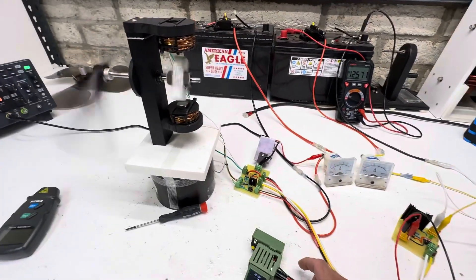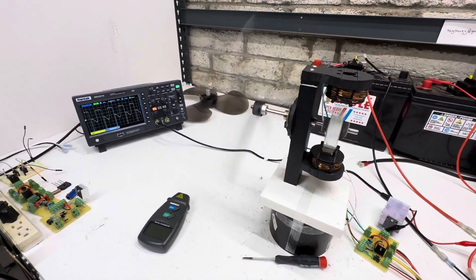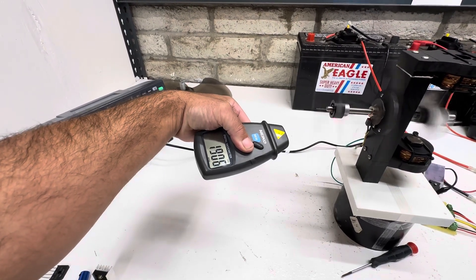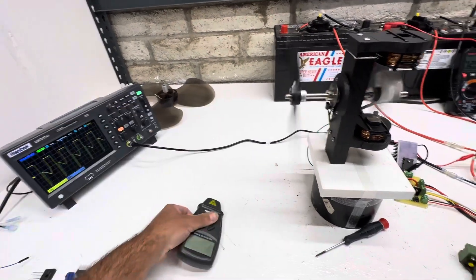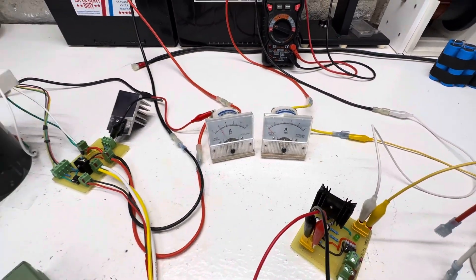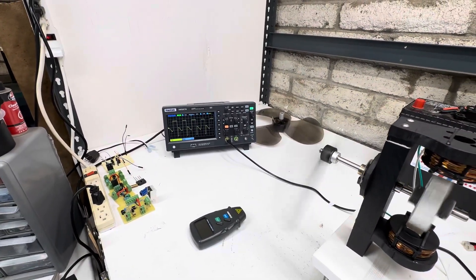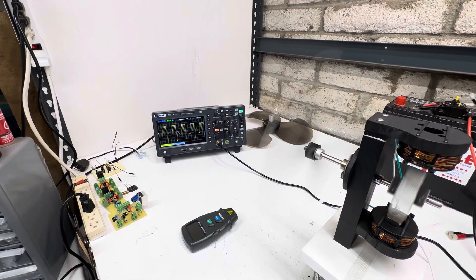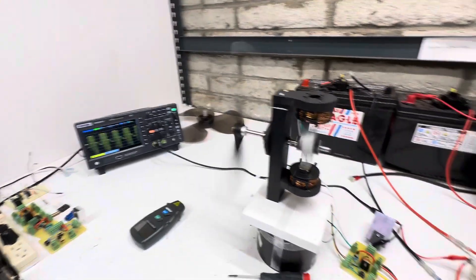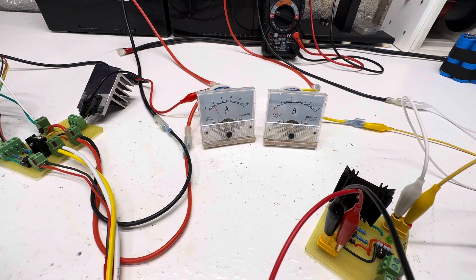This is probably the most efficient RPM right here, but we're going to bring it up to 2 amps, which is full power. Let's see what the RPMs are — 1,900 RPMs. The cap dump's still fine, but not quite as efficient. But if we back this off to about 75% pulse width, you can see it kind of chopping it up. We lost a little bit of RPM, but we're using a little bit less amps and we're getting a lot more energy back.